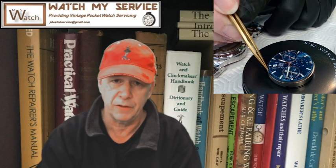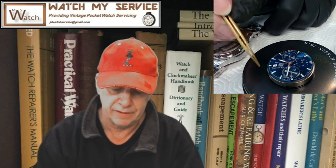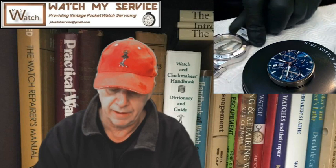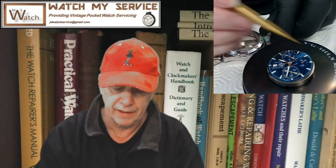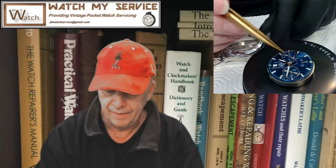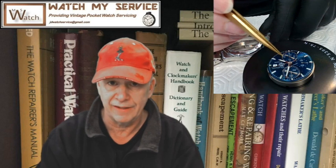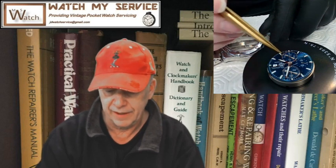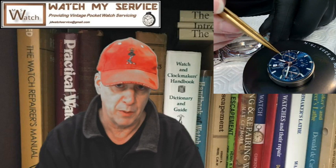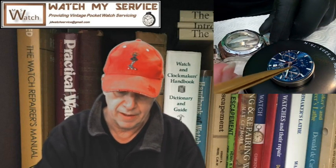A lot of watchmakers will tell you that, because when you hit the cam, and there's a heart cam on the bottom here, when I click that button here, that'll swing that hand all the way back. It'll swing the second counter from down here all the way back. And that's a lot of force to put on that pivot and to keep that hand from sliding sideways. So it's very difficult for that hand to say, I'm going to stay on without any problem. So that's the recommendation. So for this one here, I'll show you what I did to make sure that stays in place.